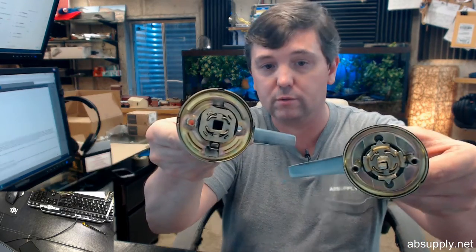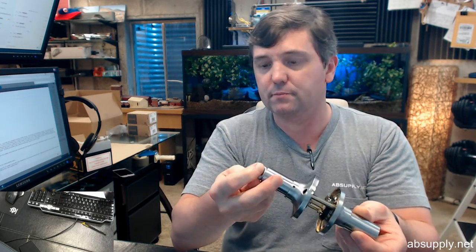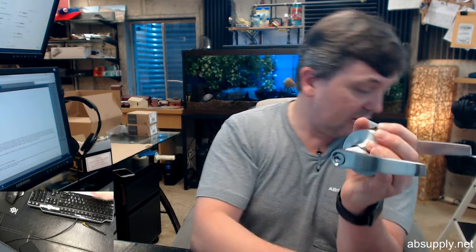what would be called a tubular lock. It's grade 3. That's just quite residential duty in nature. Okay, this is a 53 function, and that means, well, it's a keyed lock with a button on the inside. I wouldn't really call it a 53 function, but nonetheless, that's what it is. It's a keyed lever lock.